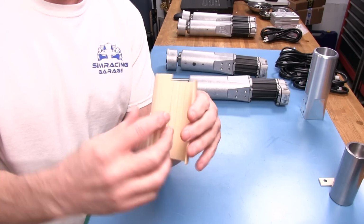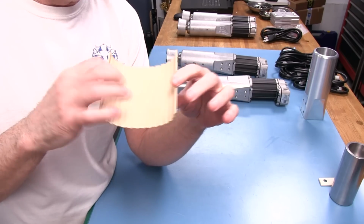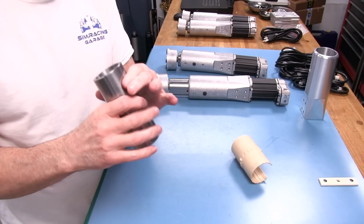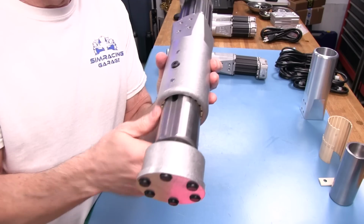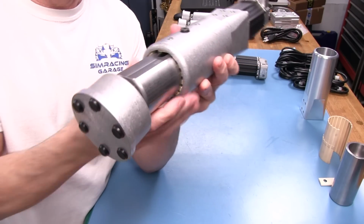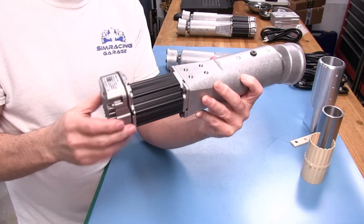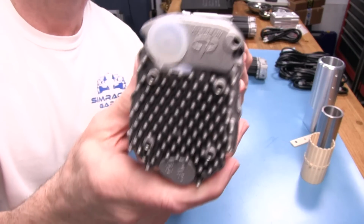The actuators employ a dry lubrication solution, using Teflon impregnated plastic sleeves to handle the friction created during actuator movement. The pistons are 50 millimeters in diameter and made of steel. The total range of the actuators is 50 millimeters or 2 inches. The motors the DK uses are quite different than what I have tested to date here at the SRG. They are ClearPath units manufactured by Teknic.